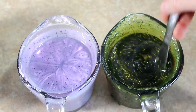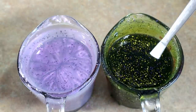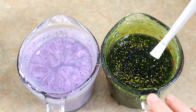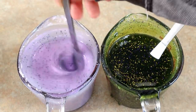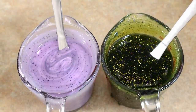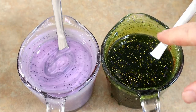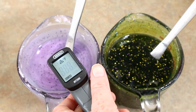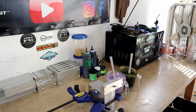Here's something to keep in mind when you're laminating a regular pigment base with a powder base: that powder is going to bleed over a lot more into the pigment base. You really need to get your temperatures low and even. There's just something about powder — I think because it's so visible — you always have a little bit of natural bleed over, but when that powder touches the other side, boom, it sticks out. So the bleed over is a lot more obvious and you get sloppier laminates.